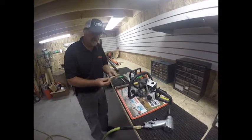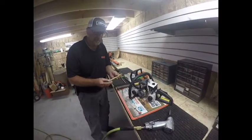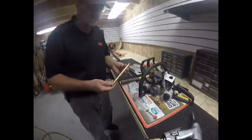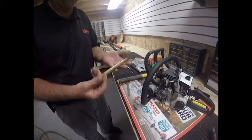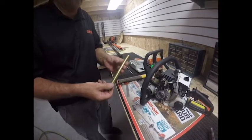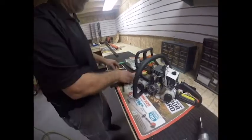What I usually use is I have a brass cylinder, just a punch — a really thick, heavy punch. Works well. It's brass, a soft alloy metal, of course, so it will not mess up threads or anything. And a good, firm hammer.